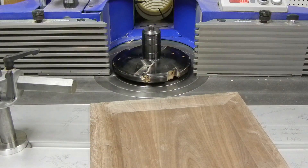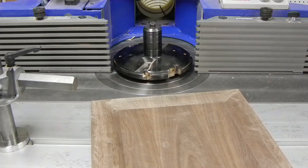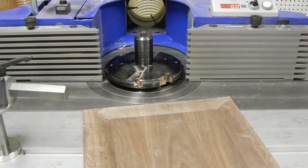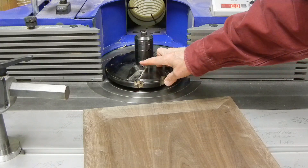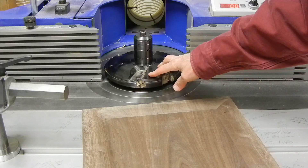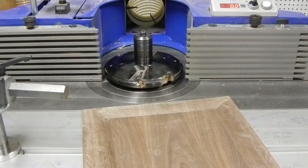This is at 6,000 RPM, 30 millimeter spindle. These are carbide insert knives — I bought this particular profiling tool from Felder. I think it only fits the 30 millimeter spindle. It's convenient because each of the knives has two different faces on it. So if you happen to hit something that puts a chip in these knives, you can loosen up two 5 millimeter or 6 millimeter screws and flip the knife around, and you'll have a sharp edge to begin with again.